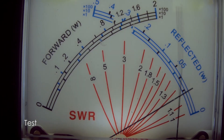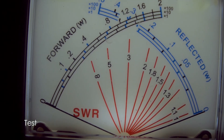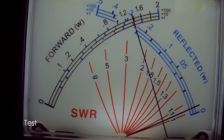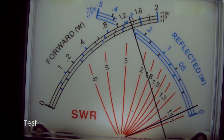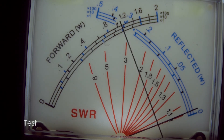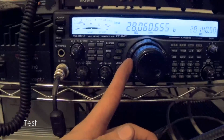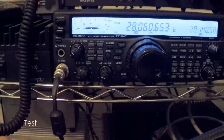Not bad — less than 1.1 SWR. It's close to 150, maybe 140 watts. Now we're listening to the KY9IG beacon because we're in popular path to Connecticut, and it's fairly strong today.